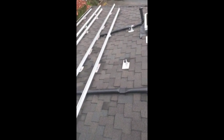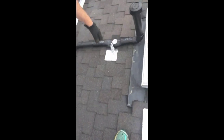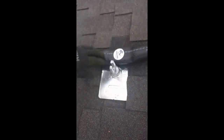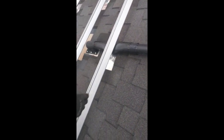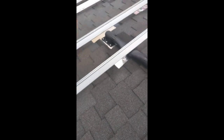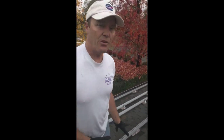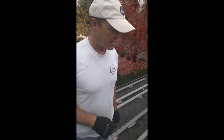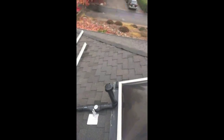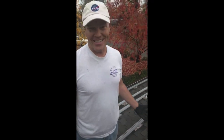You just put these flat sections of pipe where the rail is going to go across, just like this one here. These rails aren't set yet — they're actually going to be a little bit higher than that pipe. These pipes for the solar roof jack can only run either up or out to the side; they can never be oriented downward. That's to prevent a gas bubble from forming in your sewer system, which would keep your toilets from draining and flushing properly.